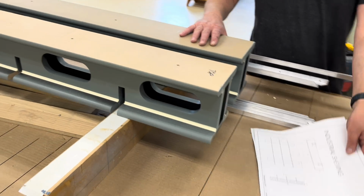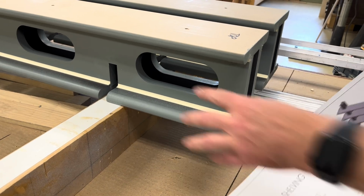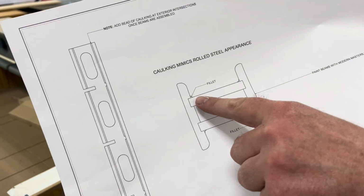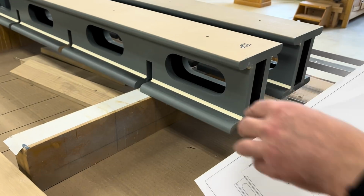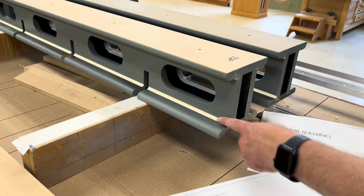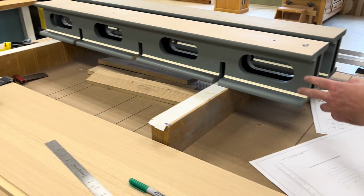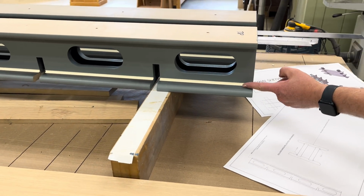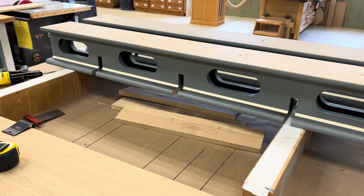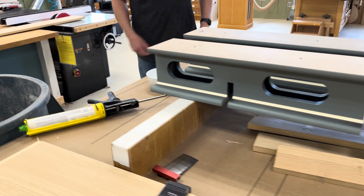Dillon wanted it to look exactly like steel, so what we wanted to do is make this corner piece here kind of rounded over with a fillet. So what I did there, after I primed and painted, we put some latex caulk there. And how I did that so evenly, not with my finger, would have been a mess. Taped it off to a 1/4 inch, coming this way, 1/4 inch going that way, green tape, and then put a whole bunch of latex caulking in. And then after that was in there, use this trick.